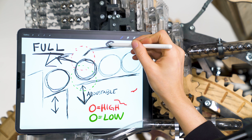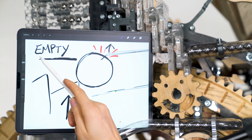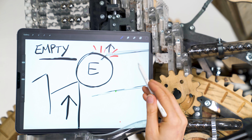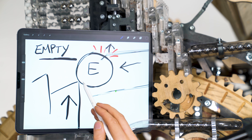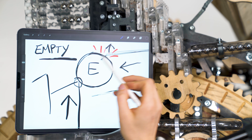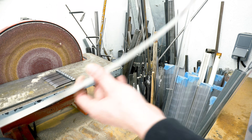What I'm going to do is add extra support for the spring steel. This means I will be able to fine-tune this complex system, and I think it will be highly reliable. But if the pipe runs empty, we have an edge case that ruins everything. This marble — E, the edge case marble — is coming at high speed at exactly the wrong timing, when the fish stair step is just about to go up, which means the marble gets stuck on the edge of the fish stair step and pushes upwards. That's why I can't have the plastic pipe going all the way forward, because the plastic pipe will just explode in such an edge case. This is the same issue I have for all the marble gates on the whole Marble Machine X — they can never run dry.